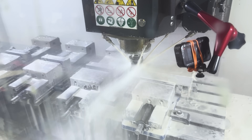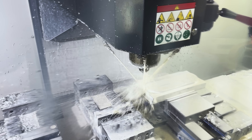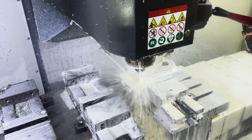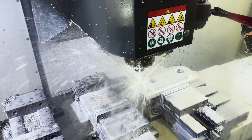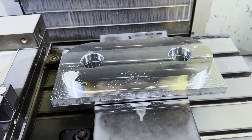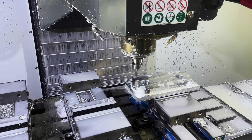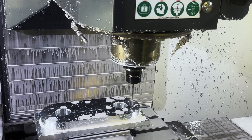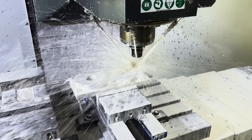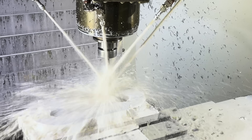To start off, we're facing that off with a three-inch face mill. We're skipping ahead in this program because it's long. We're using a half-inch end mill now to rough this part out. Not only is it roughing, it's gonna do the helical bores and also the finishing on both the bores from this side and the outer perimeter. You can see it's automatically adjusting its feeds and speeds, and that worked out very, very well. Now it's going to spot drill everything — I believe that's a half-inch spot drill. That is not sped up — that is the actual speed of the program.